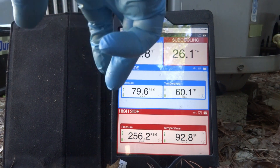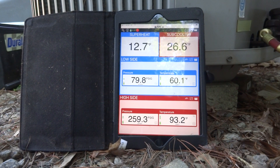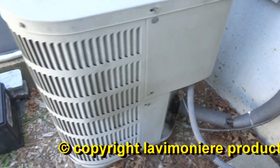That's looking a lot better there — superheat's better, pressure's up. Oil looks clean. I hit it with a hose on the coil. That'll be my final reading right there. Suction pressure's a lot better. It looks pretty clean, but every so often I hit it with the garden hose. It was low on gas — yeah, a little low. Enough to ice up.